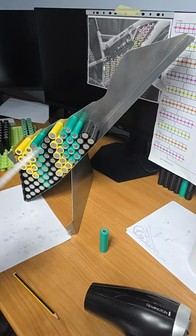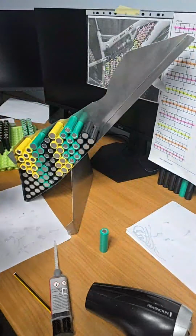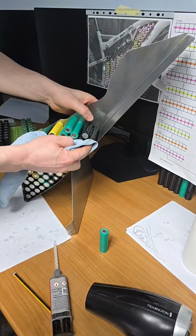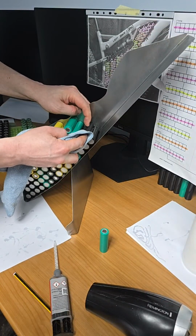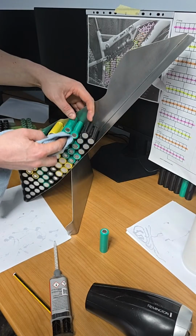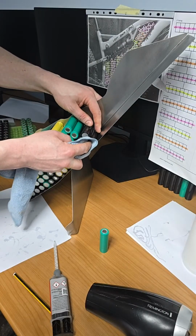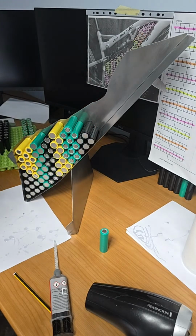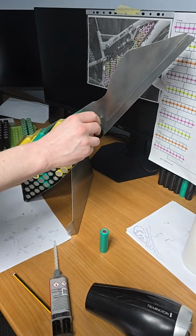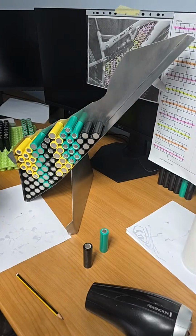Snap it away from the end. So what I'm going to do now is clean the end of them cells. Keeping pressure on them. Remember, these ones is only glued too. So making sure the glue runs smooth, and then we're going to place another cell into position. I'm going to do this exact same thing again. I'm going to put the glue on it and turn it downhill.